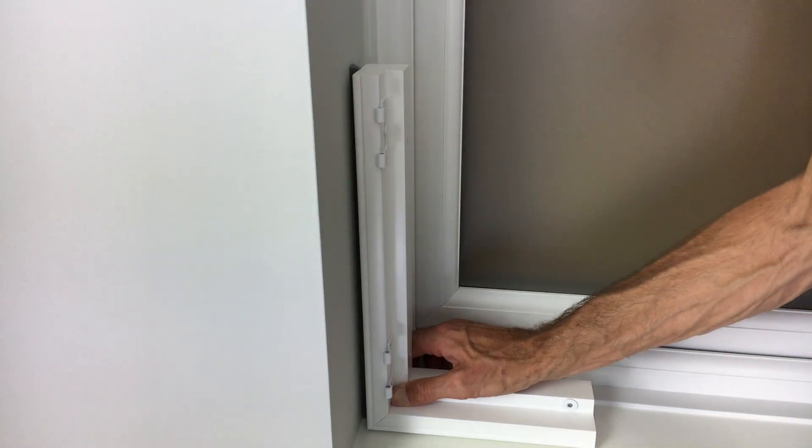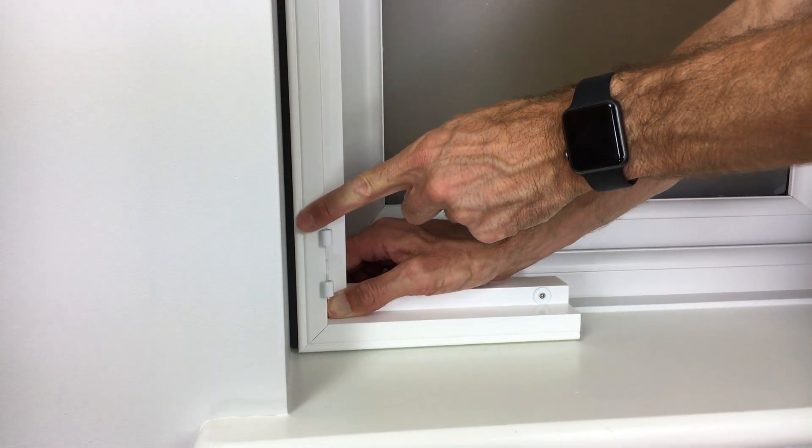Finally, where you fit the frame in your recess will affect how the shutters look from both inside and outside. The recommended default position for fitting shutters is close to the window, which looks much neater than leaving a big space behind the shutters. Fitting inside the recess will create more space and light in your room and highlight the recess as a feature — your shutters will look more fitted than part of the window. Remember most customers keep their shutters closed and only tilt the louvers to let the light in and out, so don't worry about where they fold back when open as you'll only do this when opening a window for cleaning. So now you know how to design your shutters — step two will show you how to measure.